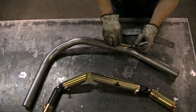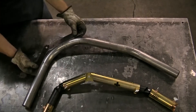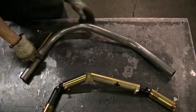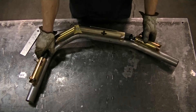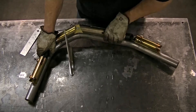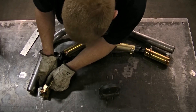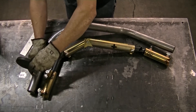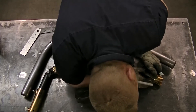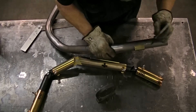Now is a good time to mark the second tangent point, which on my bender is a quarter inch from where the tube crushes. Then use the angle finder to mark the actual center of the bend. Next I can mark the distance to the copes — this is from center of bend to the long side of the cope. I got lucky that the jig still sits on top of the tube; this isn't always possible with weird bend rotations, but since it is I can use it to make sure everything's looking good. Last I just need to measure the rotation for the copes using my rotation gauge — I'm just gonna line it up with the slot, measure that angle, find the same number on the tube, and mark the long side of the cope. Same thing on the other side: line up with the slot in the tube jig, measure that, find the same number, and mark the long side or the start of the cope.